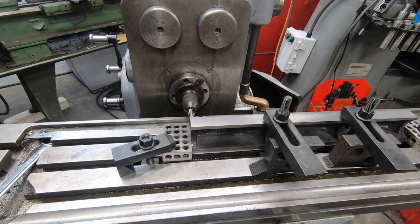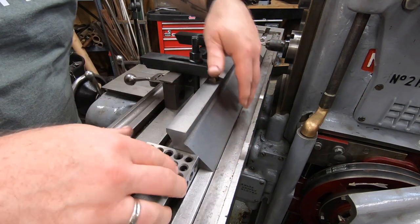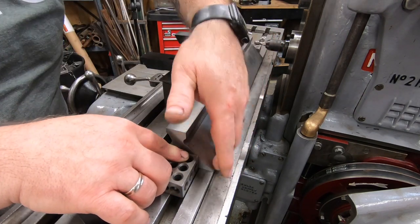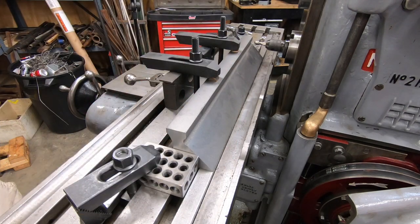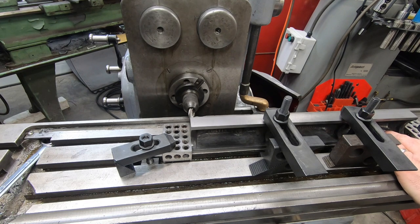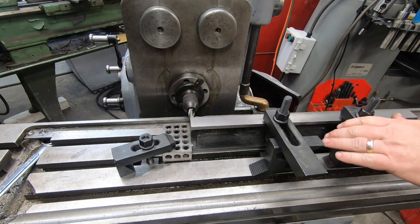Just below the top rail, there is a finger groove on the straight edge, and it's about a half inch diameter void in the casting. And I am going to machine this here on the K&T using a half inch ball end mill in the horizontal spindle.